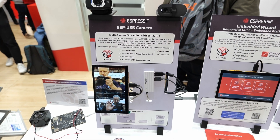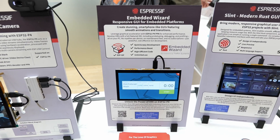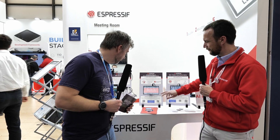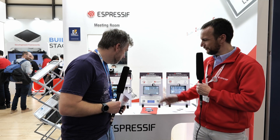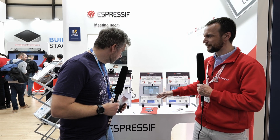The camera quality is almost as good as the one being used to film, and the ESP32-P4 is much less expensive. The P4 is very performant and has a pixel accelerator peripheral suitable for improving HMI performance. Here we have a demo developed by Embedded Wizard — selecting the graphic accelerator shows silky smooth rendering of an RGB565 bitmap with opacity, running at 55 frames per second on a screen more than 1000 pixels wide and 600 pixels tall.